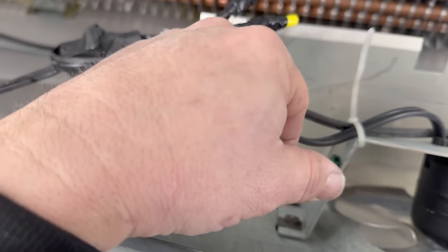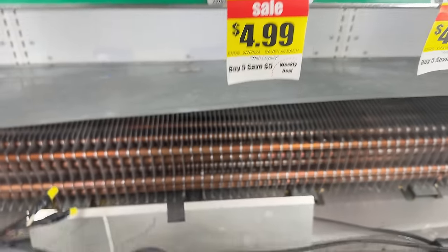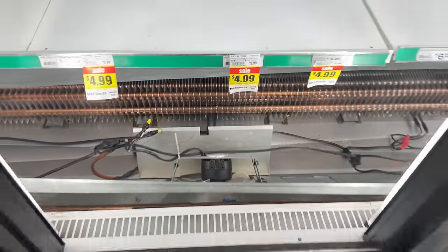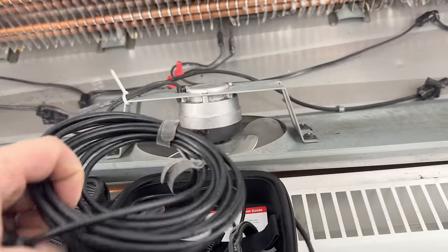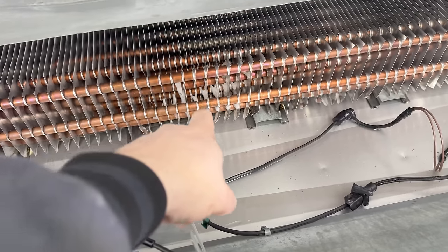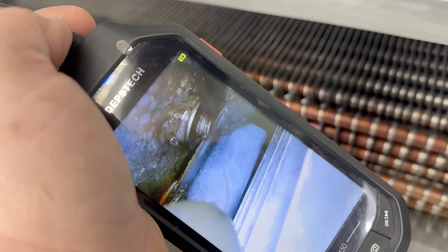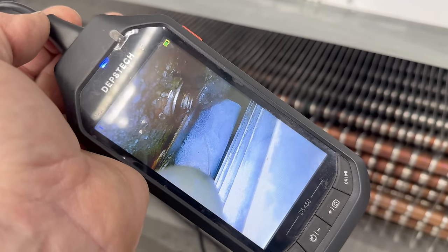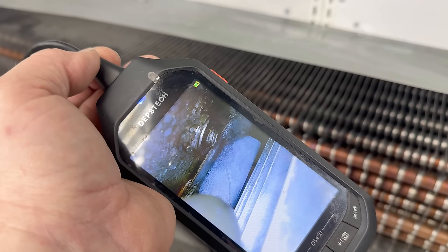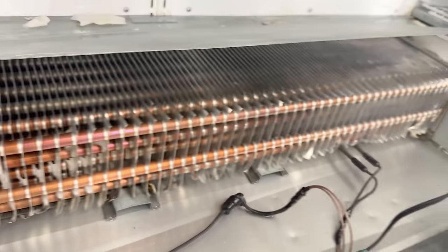So I need to get the camera back here real quick and make sure the rotation's right. I mean, it says clockwise, but some do it by lead-in, some do it by shaft-in. Here's my camera — it's got side camera and front camera both. We'll just slide that back here. I did notice I missed a little spot, but let's see if we got everything in the back. Looking at the very back — I see a couple spots at the very top of the coil, but for the most part it looks pretty clear. I want to get all of it out of there. I'm going to let the bead of water underneath here get any last residuals — we pretty much got it.